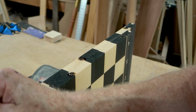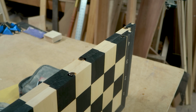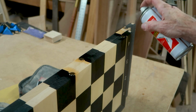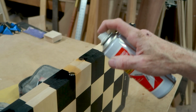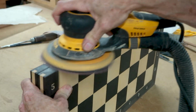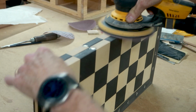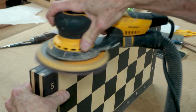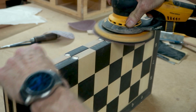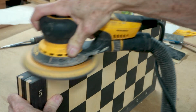After the magnets were inserted and pushed down tightly, I sprayed them with accelerant so that the accelerant would seep down the sides and hold everything in place. I thought I would only need 3 magnets on each half, but they were not powerful enough, so I ended up adding 2 more afterward. Another possibility would have been to double up the magnets like I did in the frame pieces.